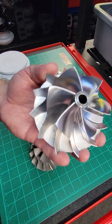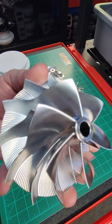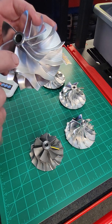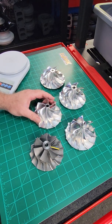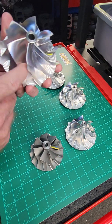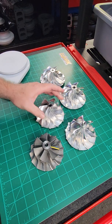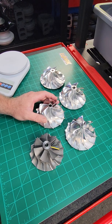Jump over here to a point milled wheel — as you guessed, the point of the tool, think of the end of the bit, creates the same curvature. What you get with point milling is a more defined blade progression: a complex curve from inducer to exducer. In the world of performance, point milling allows us to maintain a much more desirable shape on both the suction side and the compression side of the compressor wheel. Efficiencies in the world of centrifugal compressors are measured in percentages, and one or two percent can mean a world of difference in temperature and performance of a wheel.